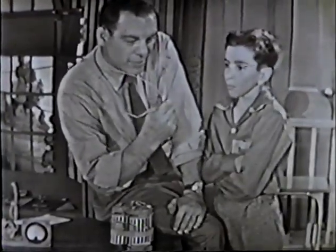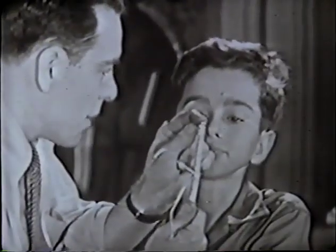Like this thing right here. Now, what's that? Well, it's an electromagnet, Mr. Wizard. It's got a nail and wire. That's right. When we run a current through there, we're going to create magnetism around the coils, and it'll sort of be funneled or made stronger by the iron core.